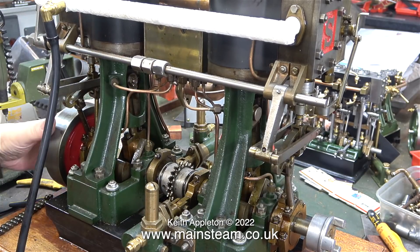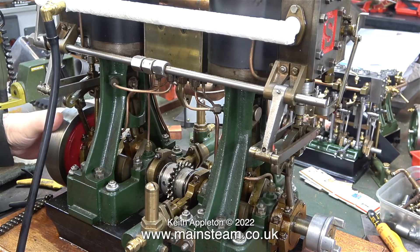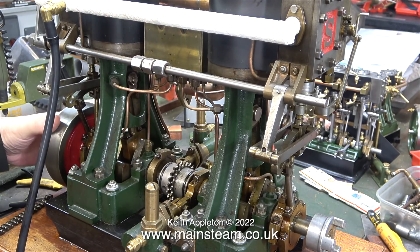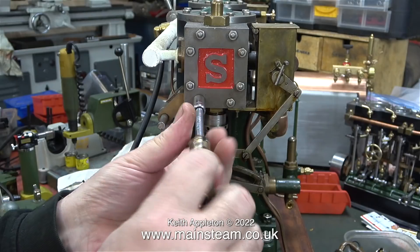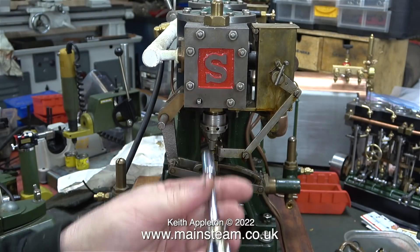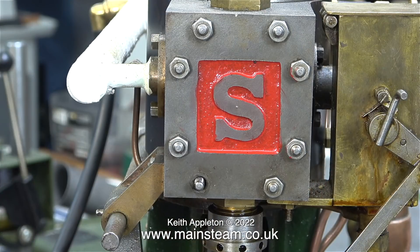Taking this as just one engine, it's a really good idea to use early admission. All this means is you let the steam in a little bit early, which cushions the moving parts and makes the engine run better and sound better. But on this engine the valve timing is obviously not in the right place.